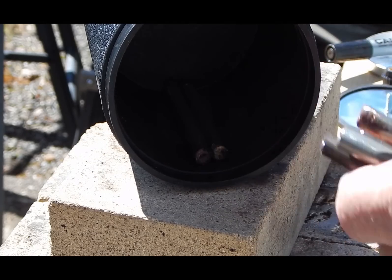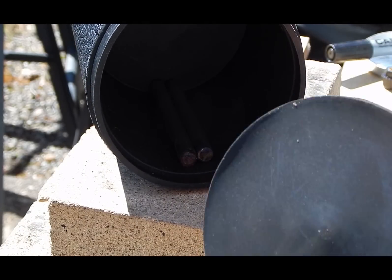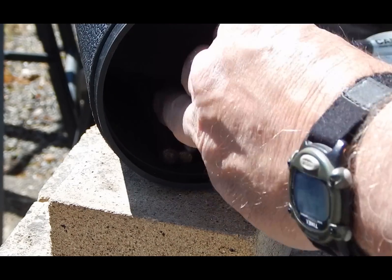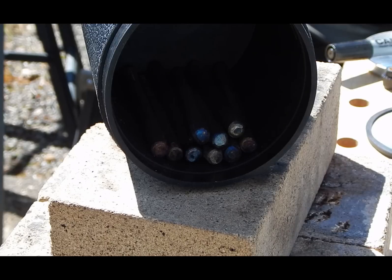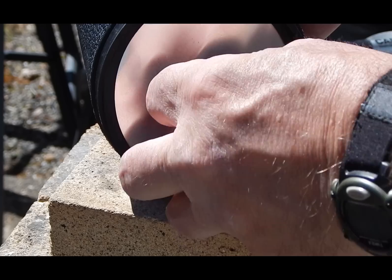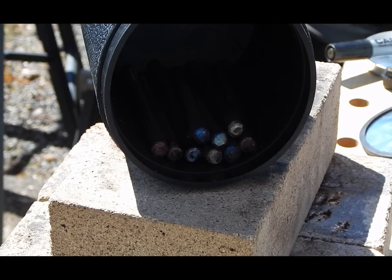The key was cutting these off so that they didn't reach to this point right here, which is the interlip for this lid to seal up against. I've got a bunch of rods that fit in there. I've already heat treated them — heated them up and cooled them off. The heat treating was just to get rid of the oil. If it happened to harden them up a little bit, that would be so much the better. I'll throw about a cup or two cups of sand in there to run through the process, put the lid on, throw a little bit of water in there for lubrication, and then just let it run for a couple of days. We'll check and see if we can crack some gold loose out of those concentrates.